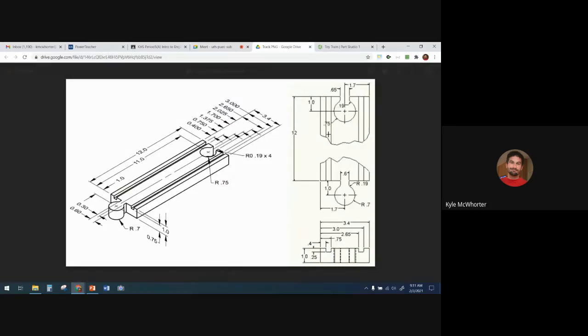Today we're going to make this piece of track. Even though it looks really scary, it's not all that bad. We're going to start by drawing the outside shape and then extruding it. The track piece body is 12 inches long. The center of the hole here is 11 inches back from one end, which means that center is one inch up from the back. The other center is also one inch away, so our construction line going between the centers of these two arcs will be 12 inches long.